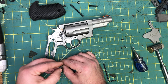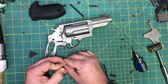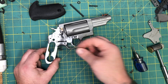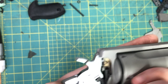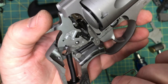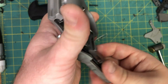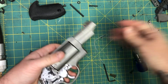Take the new hammer spring and put it on. Notice the bottom is flat and the top is beveled — you can also see where the spring rests. Press it down; even though it's reduced power, we only went 10% so it's still going to take some effort. Stick your paper clip in the hole to capture it. You have open space right there at the hammer where the hammer strut sits. Line it up with the hammer, cock it, pull that out making sure the strut is sitting where it should be.